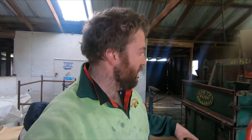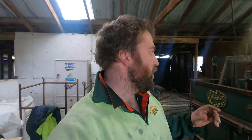Alrighty, so as you saw, we just had it going. We had to put a bit of extra oil in it. Just ran it up and down a few times, which hopefully got most of the air out. I did notice when I pulled the top off, it's literally at the top of where the oil gets poured in. So it's about the overflow, but that's with the rams all the way down.